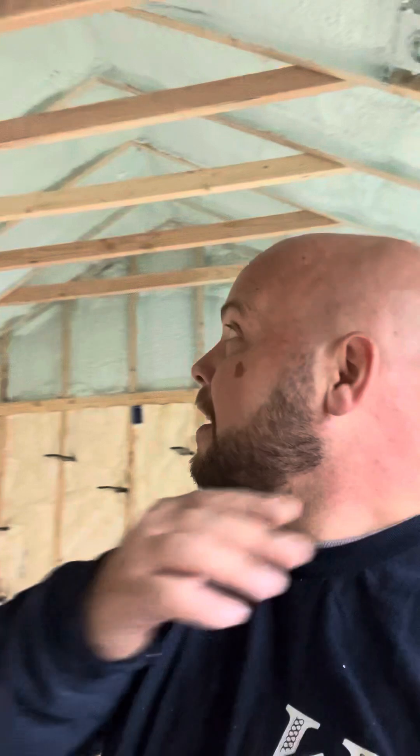One of the challenges of working with something like this is the rafters. These are ceiling joists — it's a vaulted ceiling, so they would be ceiling joists. These are 2x6. If the building code requires R30, there are a couple of problems with having a vaulted ceiling like this if it's unvented and you go with regular fiberglass batting. First of all, you cannot get the full R30 with fiberglass batting in a 2x6.